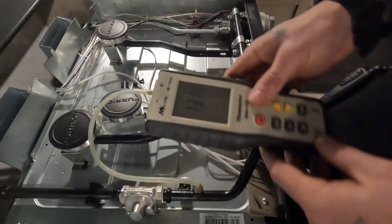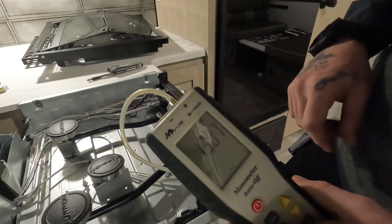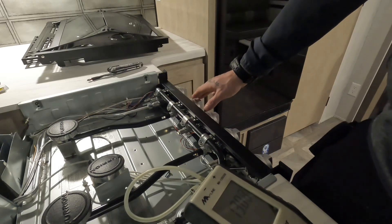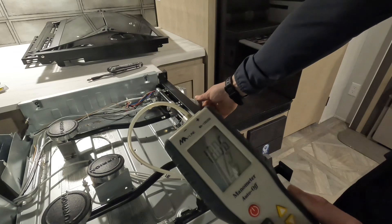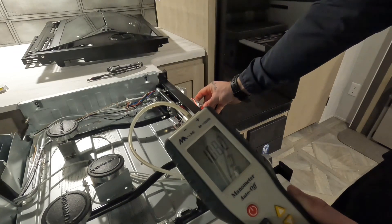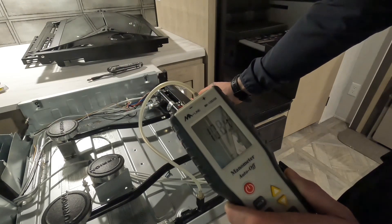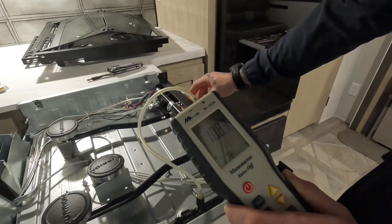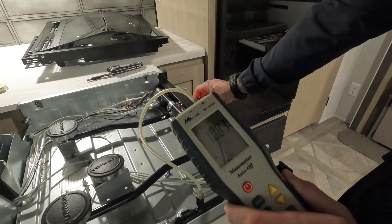Now we're going to go shut the propane off. Propane is off. This is the remaining pressure locked in the system. What we're going to do now is access one of these gas valves to bleed off excessive pressure — we want to get it down to about 8 inches of water column. When you open it, you'll notice it kind of stays the same at first, then it will start dropping drastically. So be ready to close that valve — turn that burner off — to stop it at about 8 inches of water column.